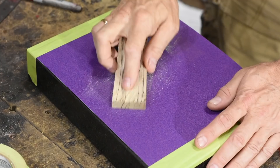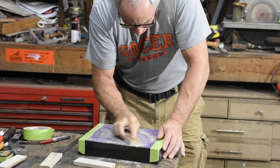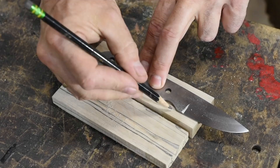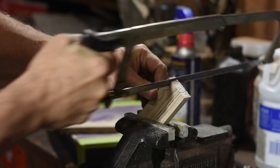After sawing it into blanks, I'll use 60-grit sandpaper to flatten it out. You really don't want to shortchange this step. Use a ruler to make sure that your wood is dead flat. If you don't, it won't lay flat on the tang of your knife properly and it'll leave ugly gaps. I'll begin by sawing out a rough outline. A million ways to do this — you could use a scroll saw, a jeweler's saw, you can hack it out roughly like this, doesn't matter. You're just trying to reduce the amount of filing that you're going to do later.